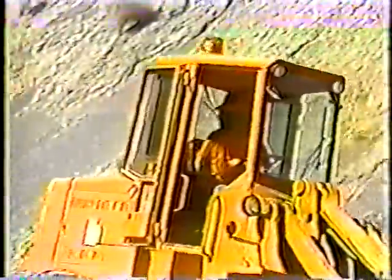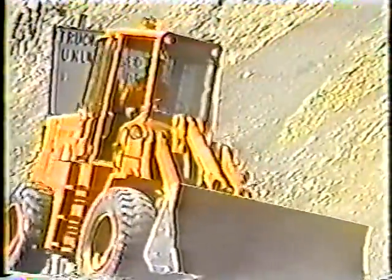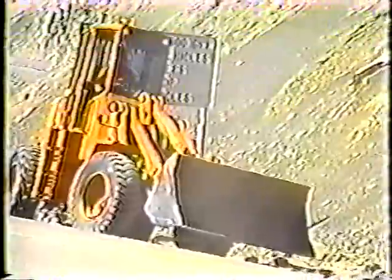The next step is to pile up the excess material. On this job, the rocks are scattered all over, so a grader is used to put the rocks in a windrow. That way, the loader operator can pile up the material quickly. There aren't many jobs that are as hard on tires as this one, so don't worry about keeping the grader going in a straight line — look out for the rocks. The whole purpose here is to move the rocks to one place; the shape of the ditch will be maintained later. With the loader, you really only have to look out for rocks when you're backing up — the bucket will push them out of your way when you're going forward.